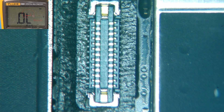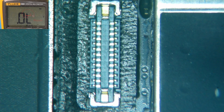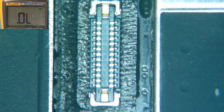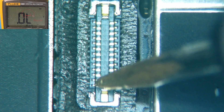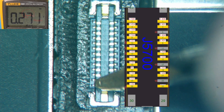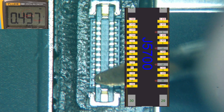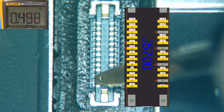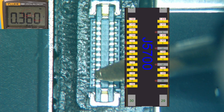So we are looking at the display connector, and I'm just gonna take some diode measurements here — put the red probe on ground. Let's see if we have values. Oh, it looks like we might have some damage down here in this area. The plastic doesn't exactly look healthy. We've got 0.271 — that looks good. Over here, almost 0.5. This is 0.36.